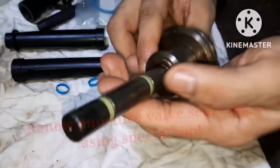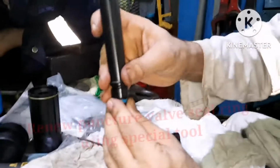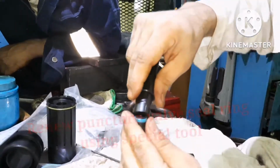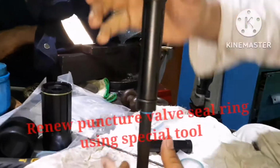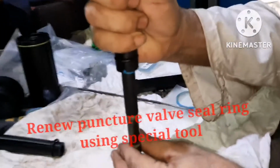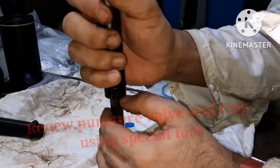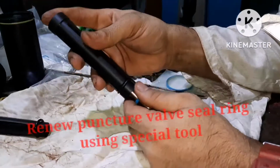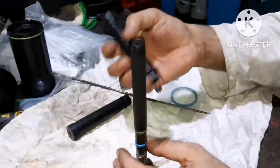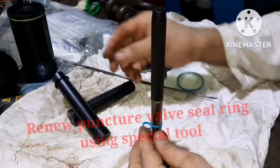You can see here in the stem there are 4 o-rings. This is the seal ring. This is the tool that we are going to use for inserting the seal ring. I had already shown a separate video to show how to use this special tool, so I won't go into the usage in detail. I can give the link in the description, so that if anyone wants to know how to use the special tool for installation of seal rings in the puncture valve, please click that link and you can see that video of the fuel pump special tool.